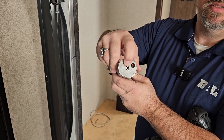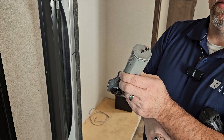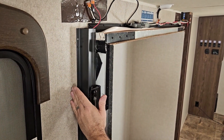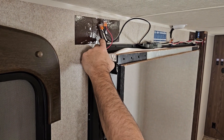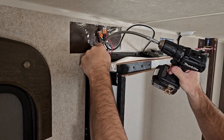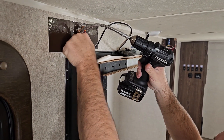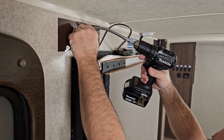That's where your number three bit is going to go in. It's going to be a little bit difficult to locate — you'll have to gain access and there may be a wall in the way. Put your hand over to the top of the jam, clamp on the outside, feel for that spot, and insert your number three bit into the top of it. From this point, you can go ahead and run your drill.